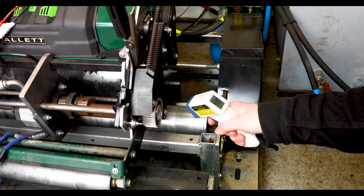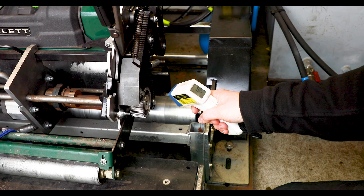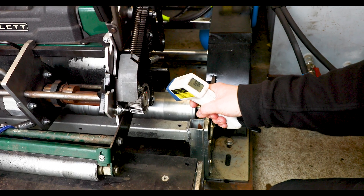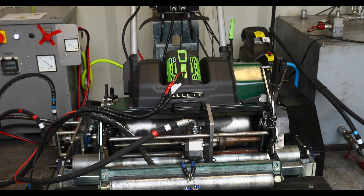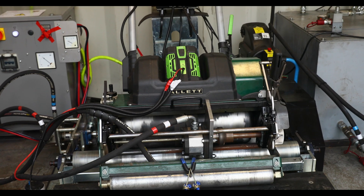So how do we check for reliability? We keep an eye on temperatures on the mower as it's on the test rig. We also remove parts intermittently and measure and inspect for how much wear has occurred. We normally test for a seven-year life and we achieve this in four weeks. It's quite an aggressive programme and we do run 24-7.